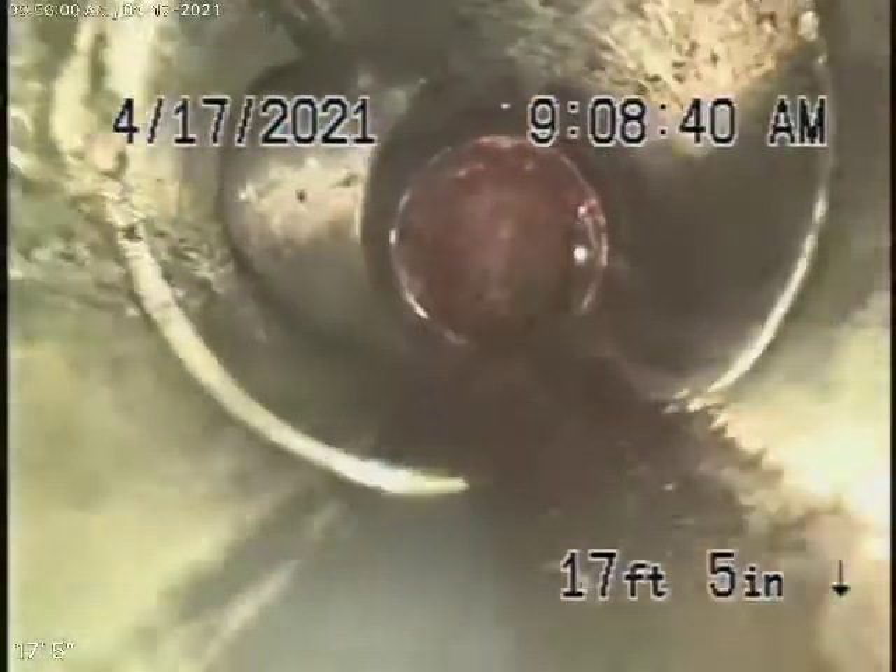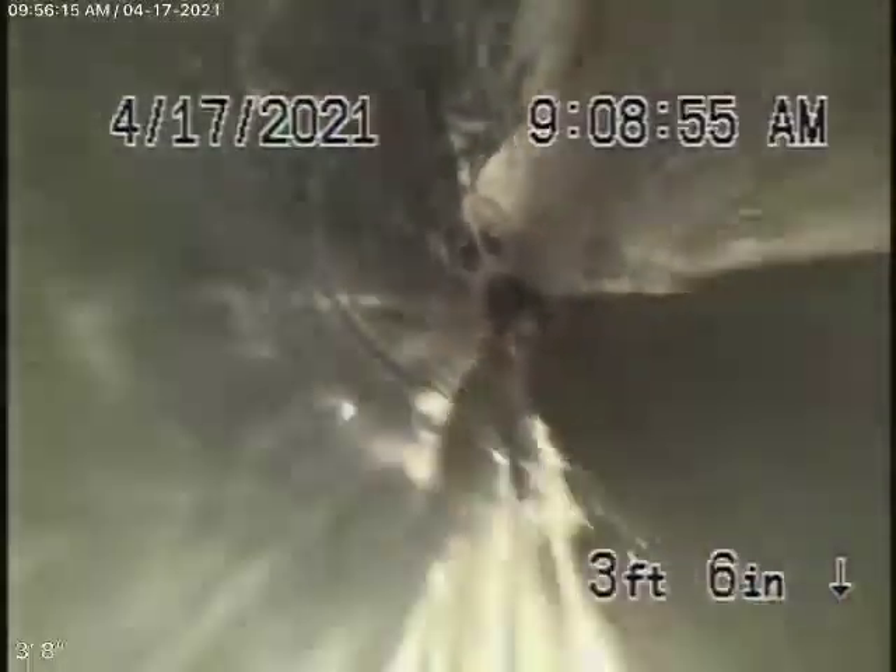So now we're transitioning to ABS plastic pipe — this is all in good condition. Overall the lines look pretty good to fair condition. We're definitely going to recommend installing a cleanout in front of the house. We'll also note that slight crack right at the city connection, which in my opinion I don't think is going to be an issue — there's no roots coming through — but we'll note that on the report.